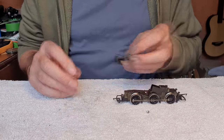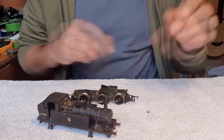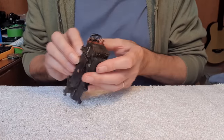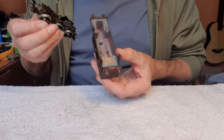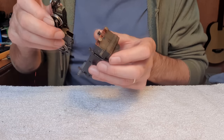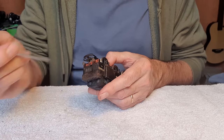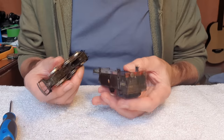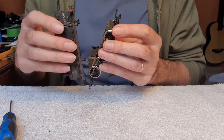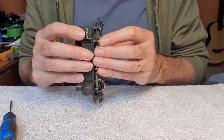We'll come back to that but meantime we'll see if we can find a way to fix the body on. So it hooks on at the front and at the back. I'm pretty sure it would have had a clip coming up from there into that little hole, but it's gone — probably somebody shoved the screwdriver in there too hard or just one too many times. I think I'm going to try making a little brass clip similar to the ones I used to fix tender bodies on, and that might just allow a kind of a push fit.